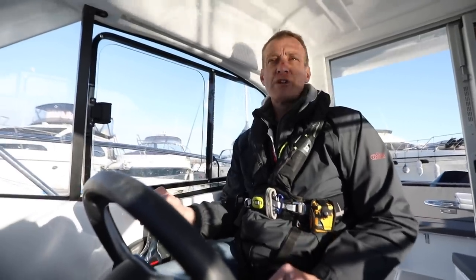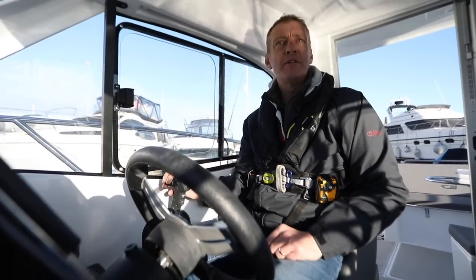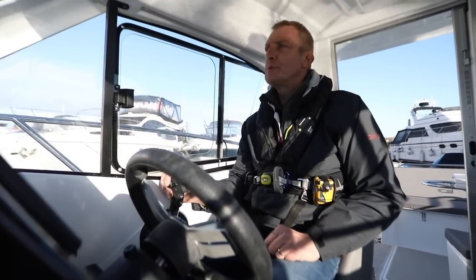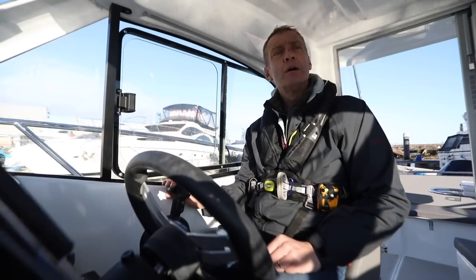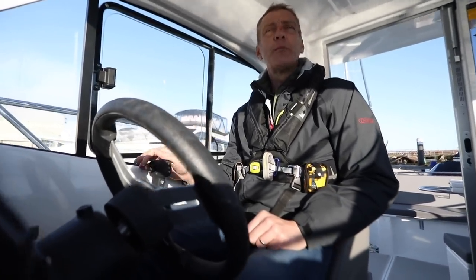So one of the things I mentioned was a little puff. These boats with a big cabin don't sit very well head to wind — they're much happier stern to wind. The little puff I refer to is needed because nearly all of them are outboard and you get quite a small propeller for your horsepower. So when you put it in gear it's great for going fast with lots of revs, but it's less good for manoeuvring.